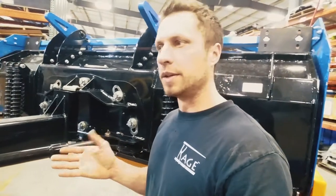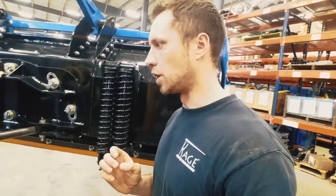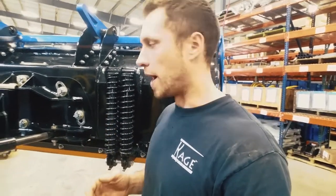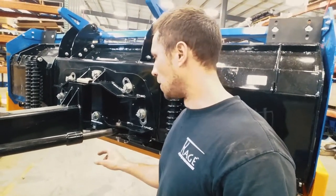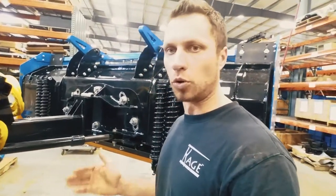Whereas a chrome-plated rod, it's just that outer shell that's really, really hard. The chrome plating is very hard, but the rod itself could bend, and in turn crack the chrome. So this is what we're using now on our Snowfire systems, and have had very good success with it preventing corrosion.